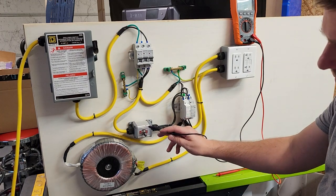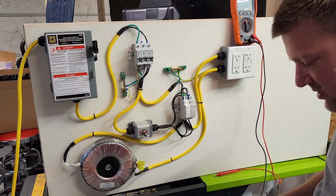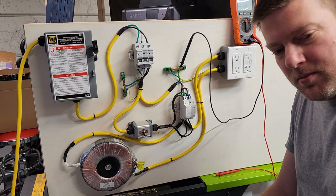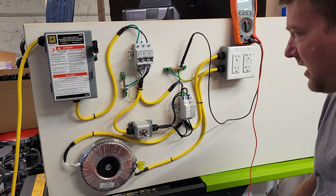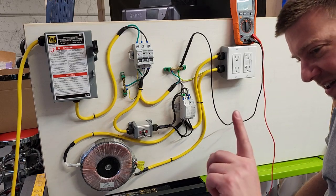In a normal configuration your three-way switch is going to be in the off position, which is the middle, and there are bus bars around. On a normal AC system, everything is referenced off of ground, so technically you can leave one lead right there and use one hand to probe around — it should work fine.